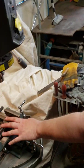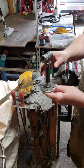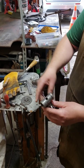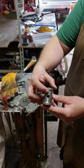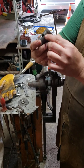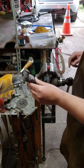If you don't have a vise like this, you can do the whole thing by using a pipe flange like this — clamp this to your drill press table and you can get the same thing done if you don't have a vise with a groove in it. And the other thing is when you line it up, you'll know that you're really in line. Like, this line doesn't look like it's in the center, but we know it's in the center of that pipe. These cast Ts are oval and all kinds of weird shapes, so don't let that throw you. Just make sure that you're putting it in the real middle when you do that.